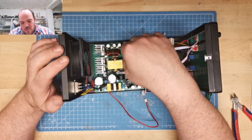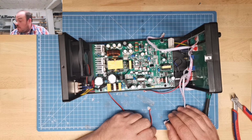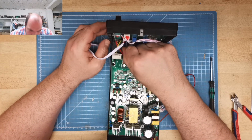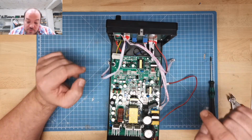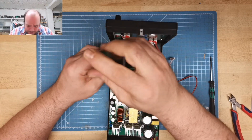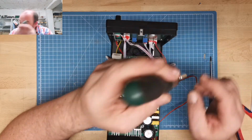Okay. Yeah, you can mess it up if you want, but with the markings, it should be easy to put it together. I hope so. Ground wire. Oh, that's the ground, and here's a little cap at the output. Yeah, those two going just underneath. That will be funny. No heat shrink on the main power supply or main power switch. So I'm not sure if this has bleeding resistors. We will measure the voltage on the caps. Maybe they are already down to 0. Maybe not. We will see.